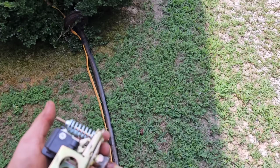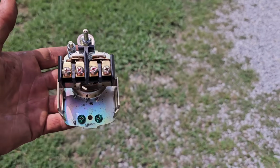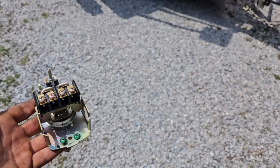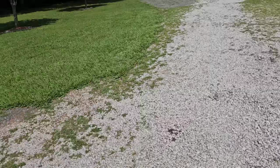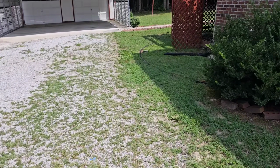The bad tank is either going to kill the switch, or it's going to kill the wire, or it's going to kill the pump. In this situation, it killed the wire. Possibly it killed the pump, and then the pump pulled 20 amps, and then the pump shorted out the wire. That almost seems more likely. But I'm going to go ahead, plumb up the well head, and turn the system back on.